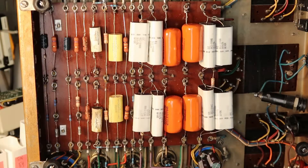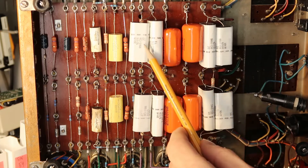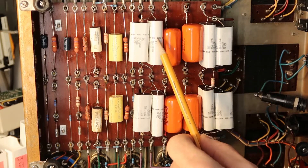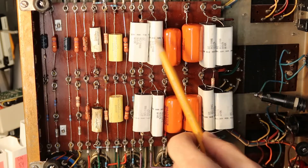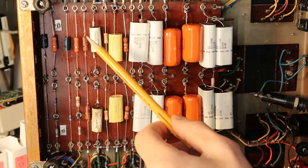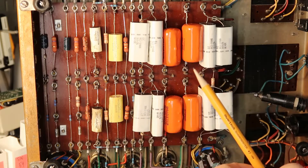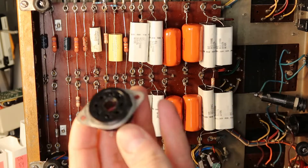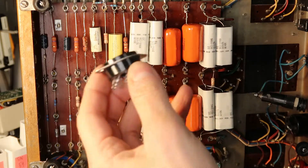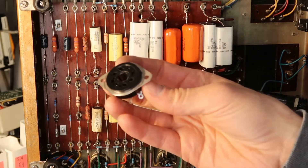So far we've got a lot of nice high-quality capacitors in here. Notice these metal foil caps are plus or minus 2%, so very tight tolerance — 40 microfarads, 20 microfarads, 60 microfarads, a little over the original 50 but that'll be fine. We've also got good low-noise metal film resistors in here and it's looking good. The next thing I'm going to do is try to get this octal jack installed — I'm still not sure why they took out the original one, but I'm going to have to reinstall it, which is not going to be so fun.